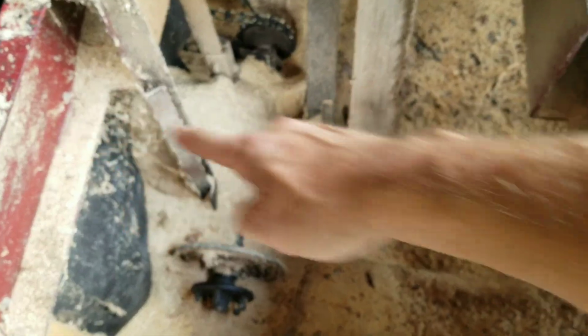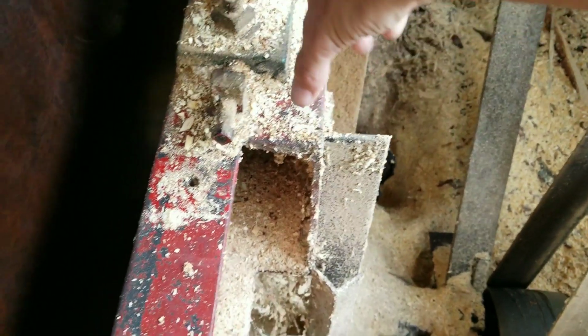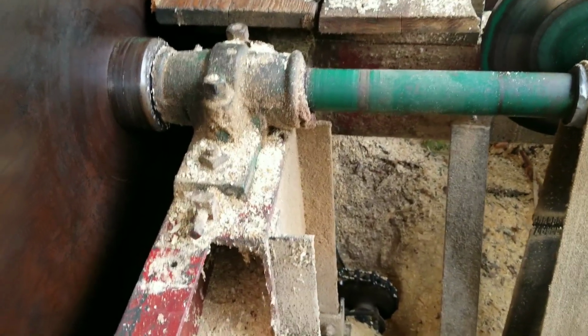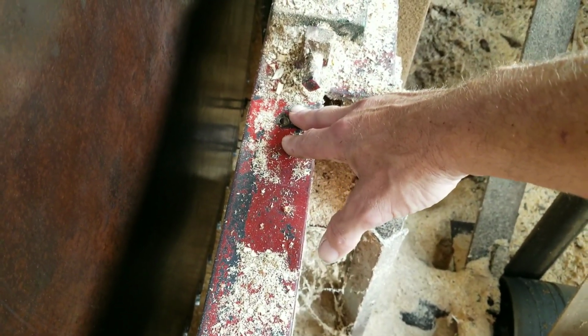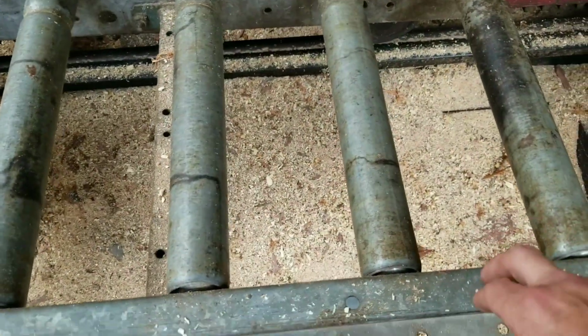All right, so I'll get some steel and go across here, and I'm thinking of having my idler wheel about right in here, wherever I can get it. And to tell you the truth, I can't really start anywhere here because it has to sit flat on, or no more than 1/4 inch higher than this. I don't want to lose much more cutting. So that would be even with what it's cutting off now if it was a 1/4 inch piece of steel sitting on top of the husk. And then that lines this up perfect with it coming off the blade.